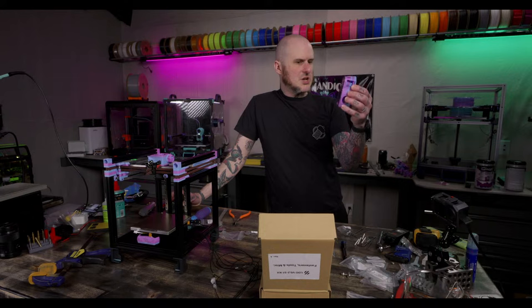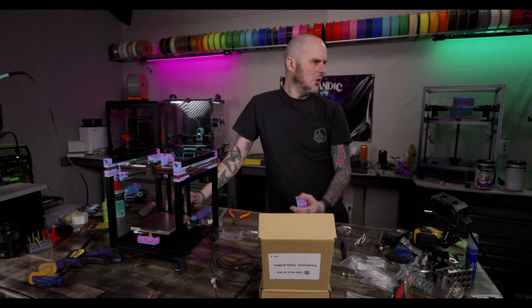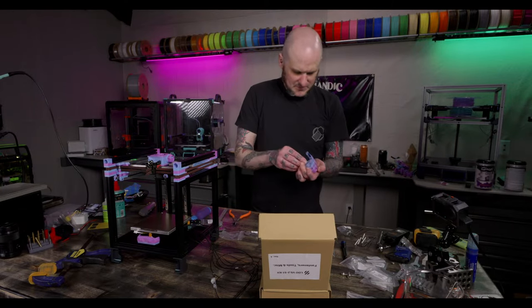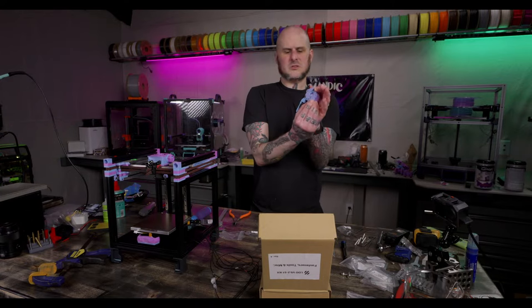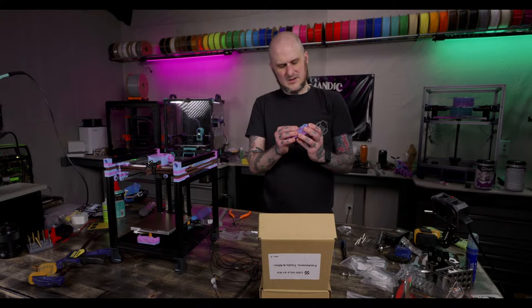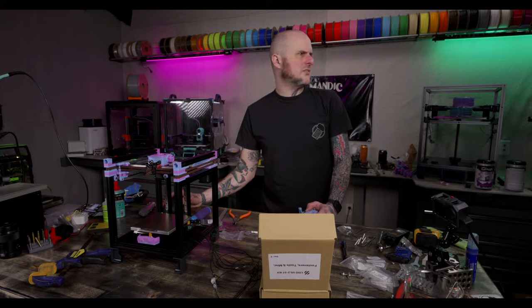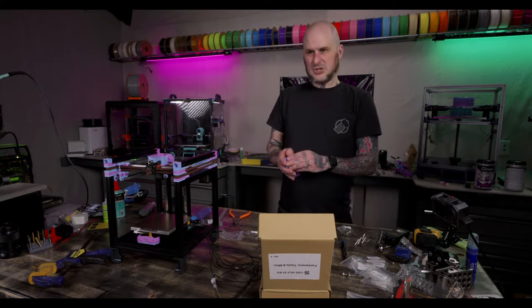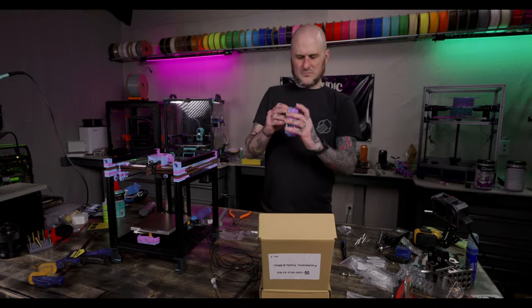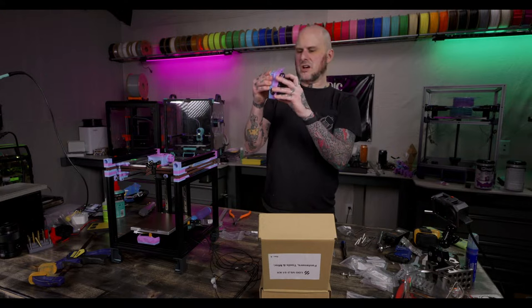Okay. So. Mini Stealth Burner is largely together. Obviously we've got the tool holder to put in yet. Get back to the instructions. Where was I at? Gear moves free right now. So, does it move free? Yes, it's moving free. Still going to be a little wear-in, it feels like, but it'll work. I've had worse. Align the drive gear. Double check that the drive gear is aligned with the filament path. It looks good, honestly.